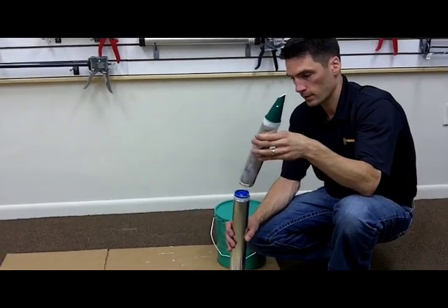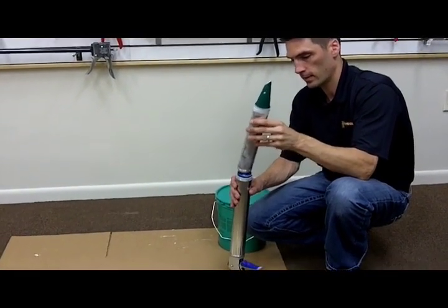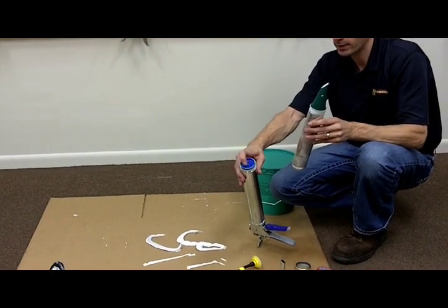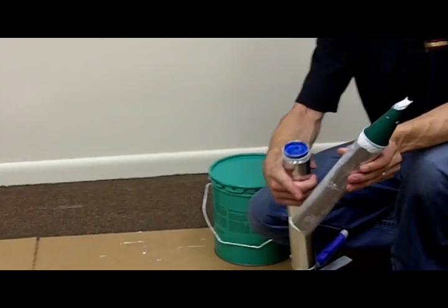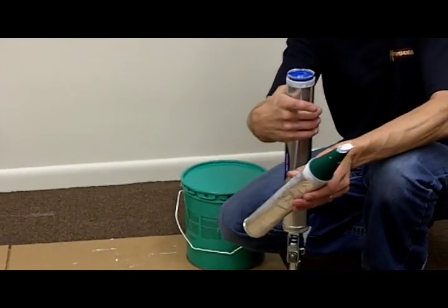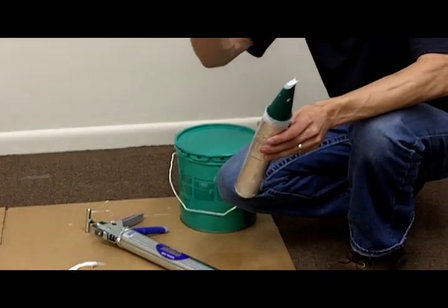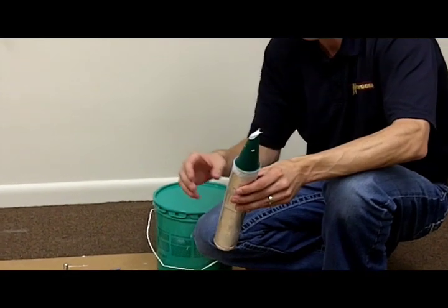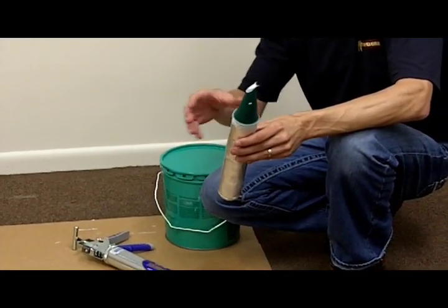After you remove the sausage pack, if you can imagine this entire sausage pack is spent, this floating sausage cup with this small indentation, which is kind of a mini version of our conical ejector, will push the sausage pack up into the cone, and what you'll be left with is like a little hockey puck of material in the sausage pack. You'll be left with an ounce or so in there, and that's nice. It's smaller and easier to dispose of.